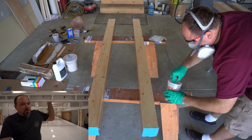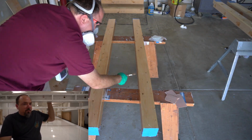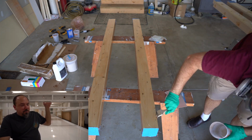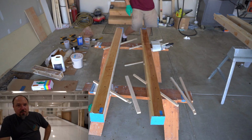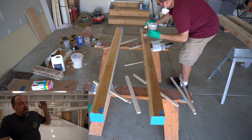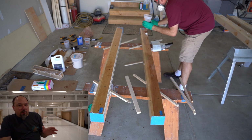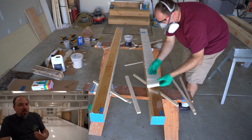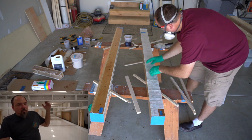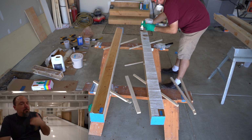If you just want to let that resin tack up, 45 minutes to an hour is what worked for me, and I just waited till the surface was nice and tacky. I would get my chop strand mat fiberglass out, put it down on the beam with a layer of resin and soak it all the way through, roll it out, get any imperfections or issues I could out with it. I would leave it overhanging on the sides and I would just be fine with it.